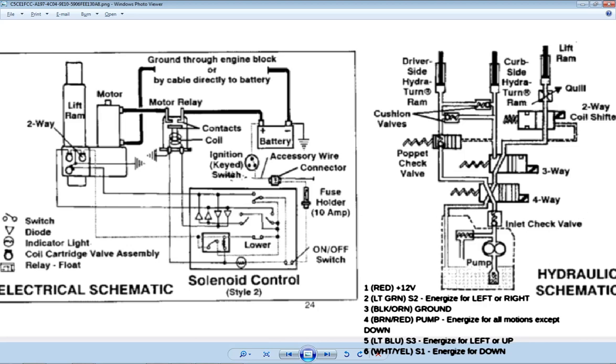The power to that section of the circuit is through the normally closed terminals of the up button. So when you push the up button, you interrupt that circuit, the coil turns off, the relay contacts spring open, and you've disengaged float mode. The on/off switch is very simple and this thing is a light bulb. Hopefully my explanation makes sense — if it doesn't, play the video again, or mute it and just stare at the diagram and figure it out your own way.